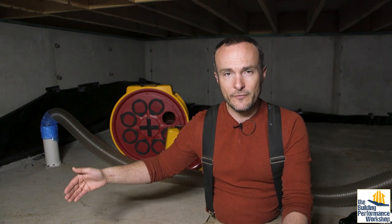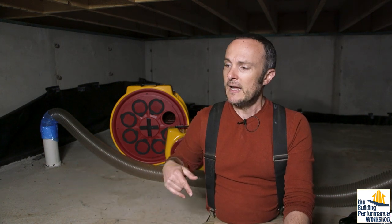At the end of that video, I said that I would bring you this video, which is about testing where those airflow problems are. Because what we want to do is just use a little bit of air to sit under the slab and on the multiple slotted drain tiles that we've got on the inside and outside of the footing of the foundation, so that we don't have to use a lot of energy to depressurize the slab massively.